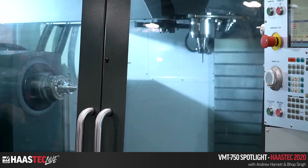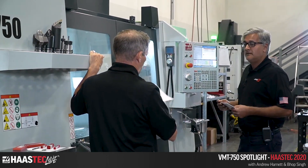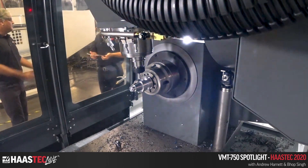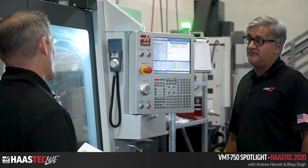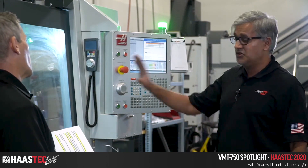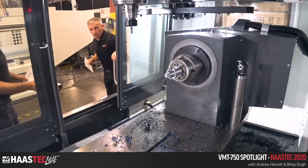The B-axis allows curved and contour machining on the front face. Tool center point control isn't active on this machine right now, but it is planned. Engineers have come down to the shop and said 'hey, to keep the cost down' — they've actually split one component into two different designs so they can machine them more easily. That raises cycle time and cost. This machine goes the other direction — I walked the shop a couple of weeks ago in assembly and found quite a few components we can reduce into one just with this single machine.